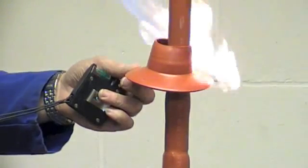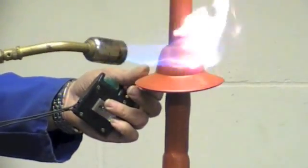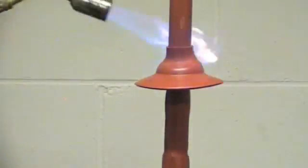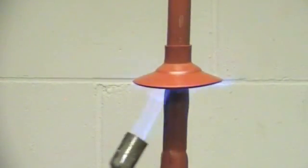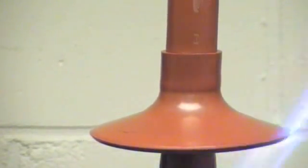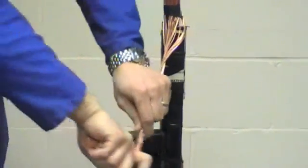Make sure the rain shed is fully shrunk to the core. Quite often, rain sheds are fitted onto a cable termination before the cable is installed up onto the pole or drop box. Sheds can be knocked about, so once the cable has been installed and connected to its lug fixing point, apply a little more heat around the shed to ensure any gaps are closed. If you've used any PVC tape on the core for phase identification, please remove this now — the carbon deposit can get underneath and will track over the top.